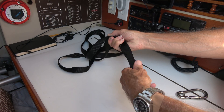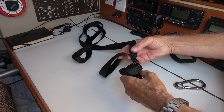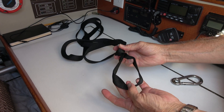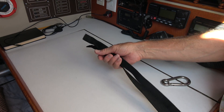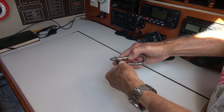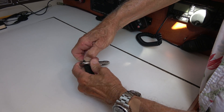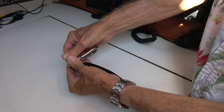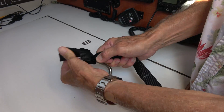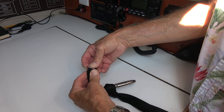I find the center of that and tie a little overhand knot to make a loop, which will be used to attach the tether to the jack line. Then I have a four inch stainless steel marine carabiner which I will attach to the other two ends, tied on temporarily until I'm sure of the length. In addition to the knot I'm also going to put a little stainless steel butterfly just to make sure that everything stays together during testing.